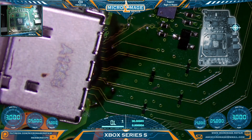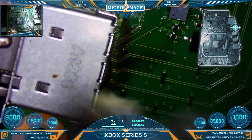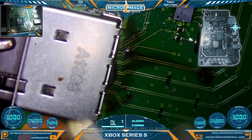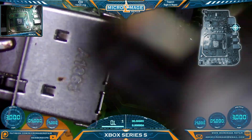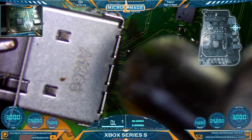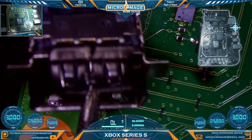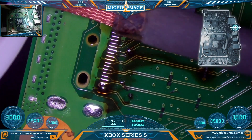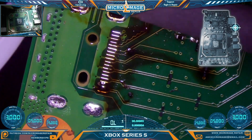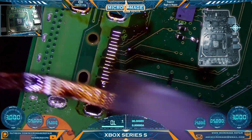We're going to grab our hemostats and clamp them onto the port, and we're going to come in with full power and patiently remove this port. I'll be very cognizant not to mess up that boost driver. Gently remove — nice clean pull. Let's clean up; it will be greatly assisted by the low melt.